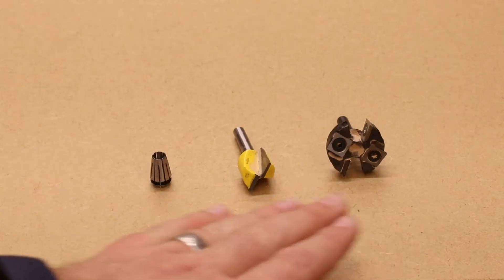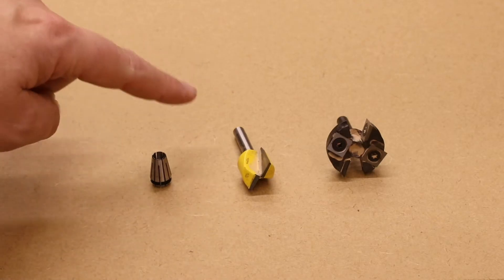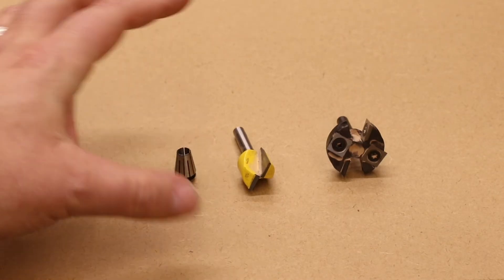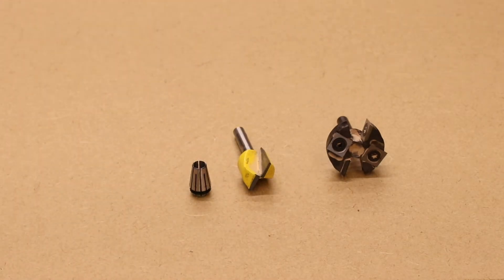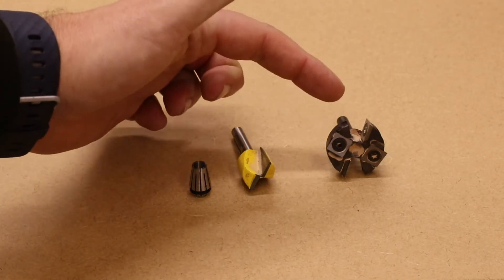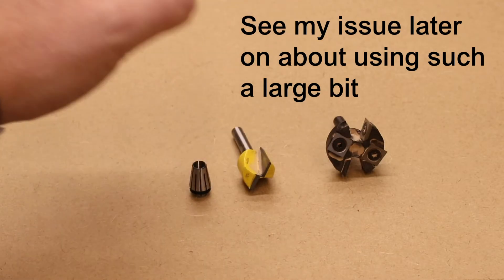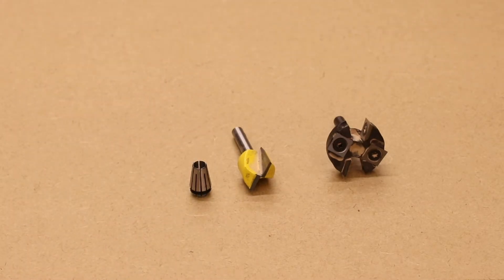Surfacing the MDF essentially means taking a very thin layer off the top to guarantee everything is perfectly flat. In order to achieve this, we are going to need to fit a surfacing bit. These typically have a quarter inch shank, so you will need an ER11 quarter inch collet insert — I'll put links to everything in the description below — which will allow you to fit one of these bits into the standard 60 watt spindle. There are different types available. This one here is a fairly cheap one off somewhere like Amazon, probably around $20, and it will do the job OK, but it can start to blunt fairly quickly. Something like this one over here looks a little bit more complex and cuts with multiple blades — it is a better type of bit but costs a little bit more, around $40. This one is from Speedtool. The files I'll be using today will work with either size bit, allowing for different variations and a bit of tolerance.